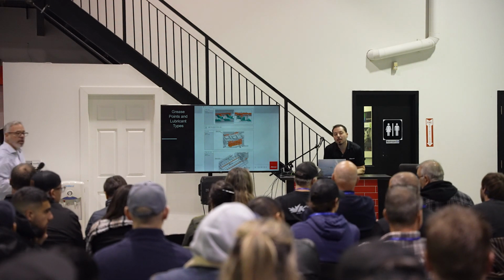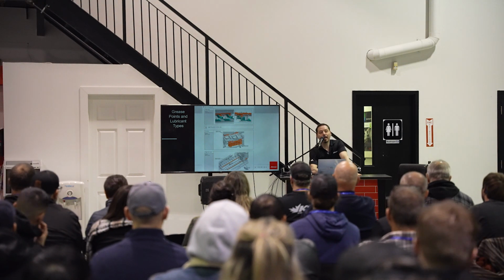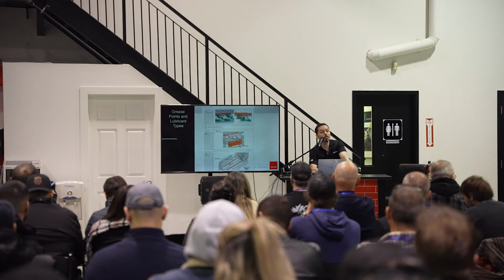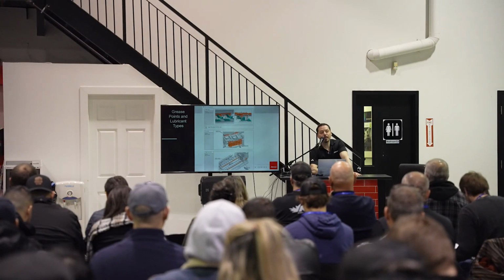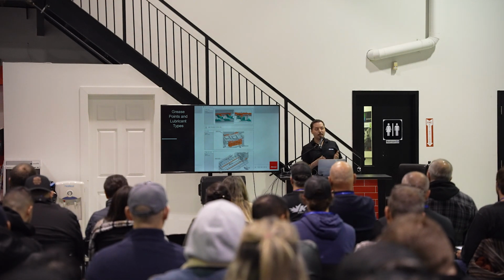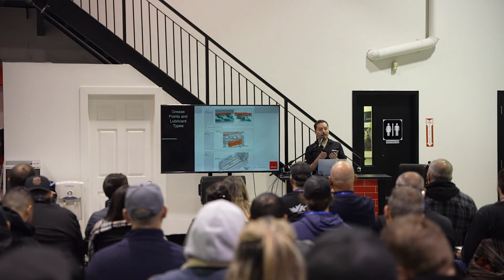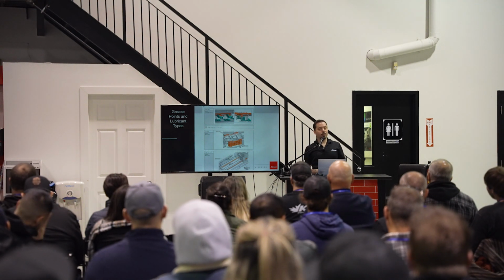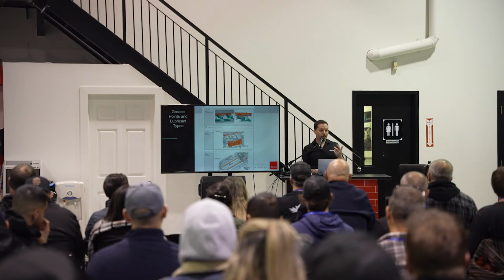Okay. The question was, how often do you need to change the cap top? So the cap top is typically about 6 months. I say that, but I've seen them go up to a year. It'll depend on usage, how often you clean it. A new one, once it gets to you, you'll see that the borders are pretty square. What will happen is, as it gets used, it'll open up and it'll start to flatten. Once you have a misshaped cap, you invite air during the cleaning cycle, that purging cycle, and it just can't purge properly because it needs a good seal. So when you start to see the walls not look perfectly square, that's another reason to change it.